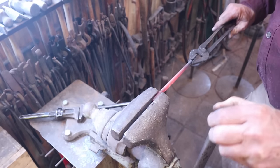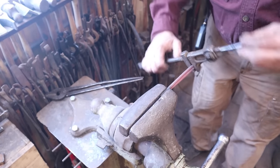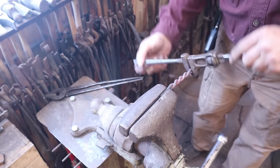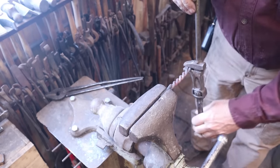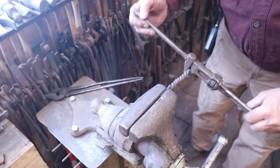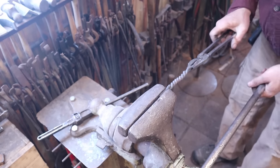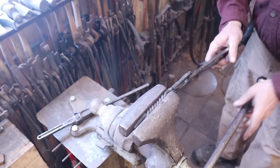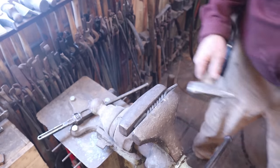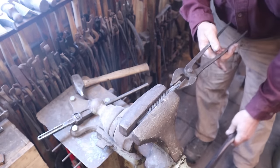I'm going to put the weld in the vise so it's well supported and less likely to shear as I twist it. That's one turn... two turns... three full turns... let's go to four. I've left some end untwisted here. That's four full turns clockwise. We'll explain why I've left so much untwisted. Try and get it all straightened back out as much as you can.